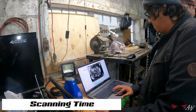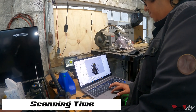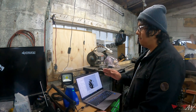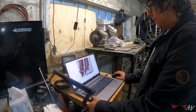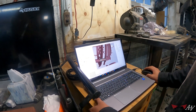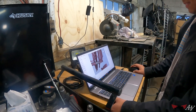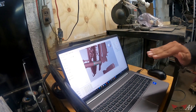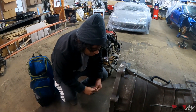The guys should show up any minute and then we'll get started on the scanning process. The first scan was 121 frames, the second scan was 300 frames — more frames is better, up to a point. If you loop around it won't line up exactly because it gets out of tolerance, but they all smooth out. I'll take this screw, add a cylinder with a radius, and it does a best fit — anything green is indented into the screw, anything not green protrudes outward, so it takes the average around the circle.